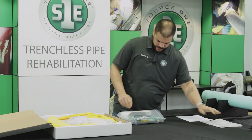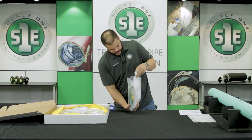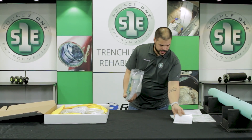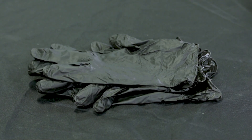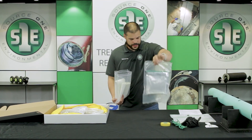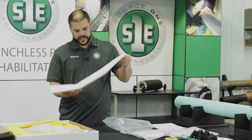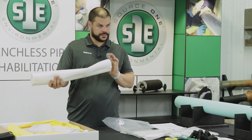You're going to get a work surface in your kit which you'll be able to put on the table that you're working on. There's going to be protective sleeves which will go on the packer when it goes in the pipe to do your repair and your dry run. You'll have your spatula to spread your material, you'll have gloves, green ties, there'll be an entire roll of tape, there'll be the resin that you need to do the repair in the kit, and then our fiberglass which is going to be a little bit different than our normal kits. This is actually a tubed fiberglass so there'll be no folding of this material.